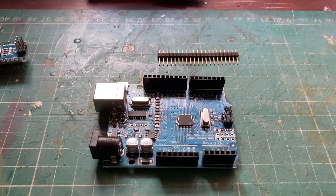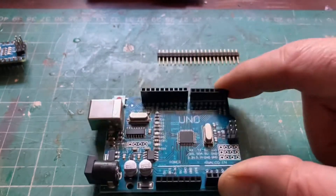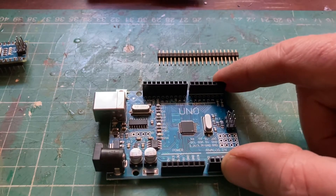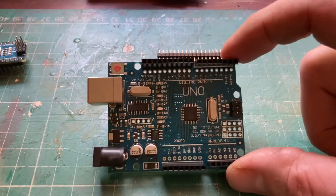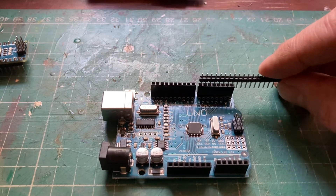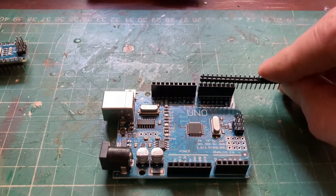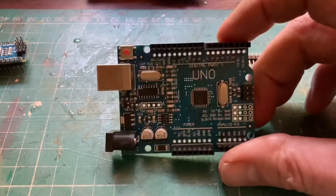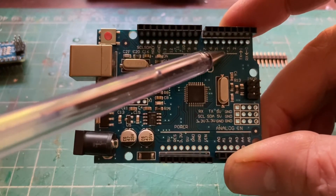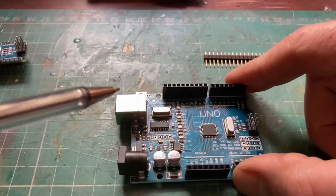So let's look at what we need for this project. This is an Arduino — if you haven't seen one before, this one is the Arduino Uno, which is probably the most popular one for these sorts of projects. It's got quite a bit of flexibility and it's more or less ready to go. When you buy one, normally about five quid, they normally come with a roll of header pins as well which go into the terminal blocks, and you can just break off as many as you need — useful for soldering wires onto so we can plug it straight into the board. There's a row of numbers on here which tell us what number each pin is, which we'll make reference to later.